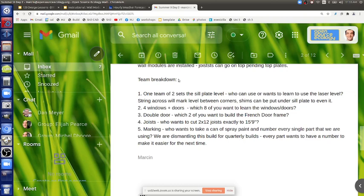So there's problem solving there. All the problem solving comes about when things don't go right, and that's when the skill is required. Otherwise, it's seamless. But we can just leave it as is, or we can raise it. So the first thing is get data points. Exactly what do we have? Because when we measured before, we basically had a 2-inch slope over the entire pad. We measure all the corners.